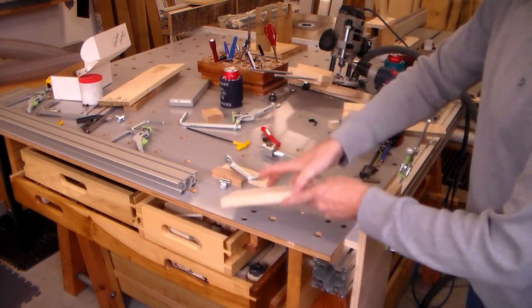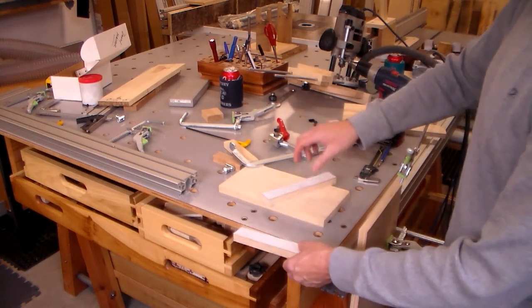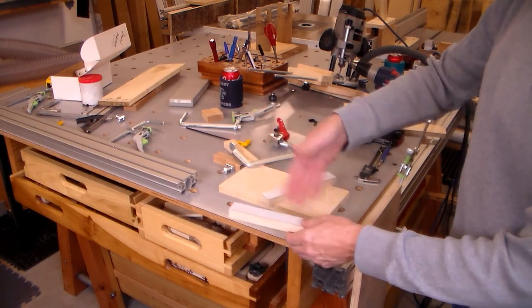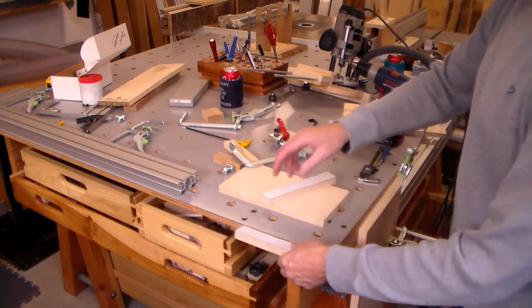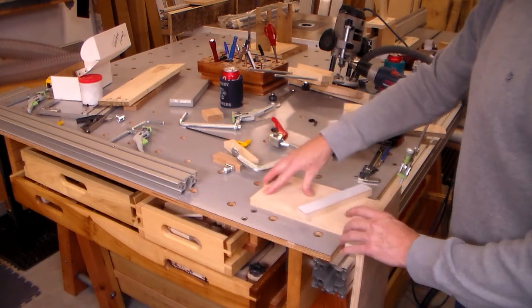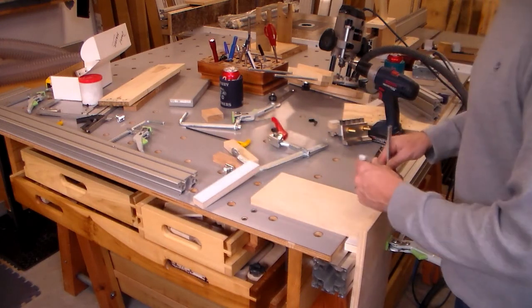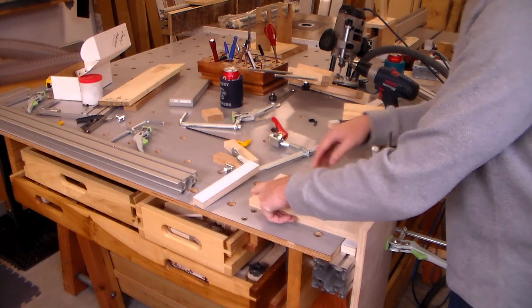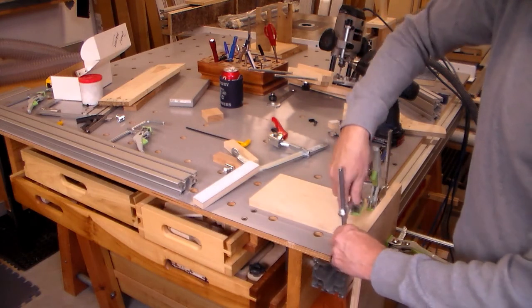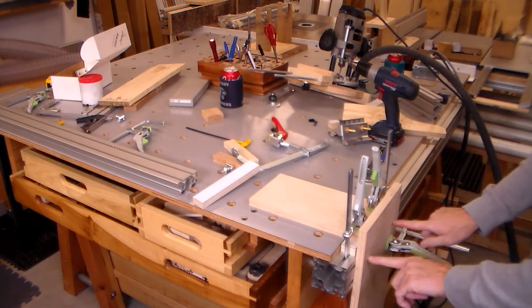And if you had a horizontal piece, what I did was I made a bunch of shims basically from my leftover outfeed table — I had some strips, just ripped them again and cut them into various lengths. They are the same thickness as my tabletop. I lay them in here, bring my horizontal piece in, position it, clamp it, and now I am ready to bore — whatever you are going to do.